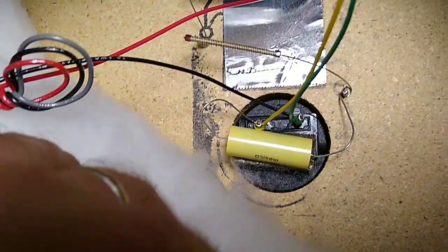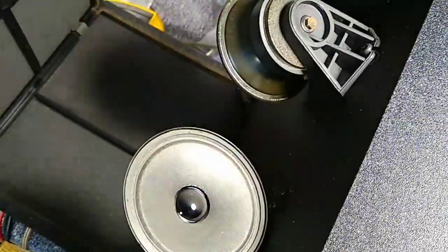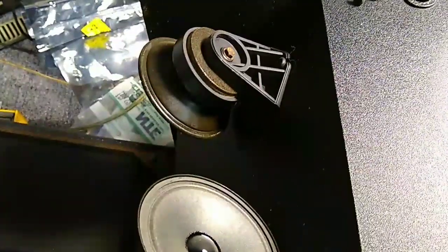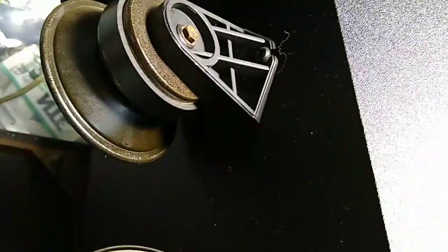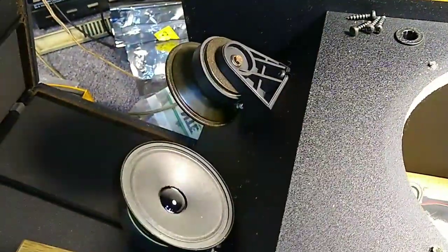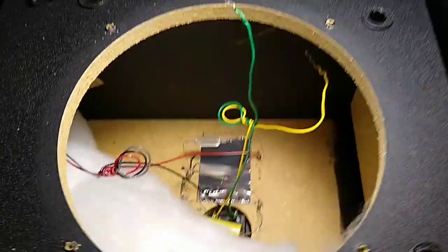And of course there's the giant capacitor there that takes the DC away. On rare occasions, if that resistor is open or the lightbulb is open, the tweeters are probably dead — but that hasn't happened here. I believe that most of the 301 Series tweeters are interchangeable with some of the 501s and some of the 601s; it's basically whatever has this triangular bracket thing here. They wire these tweeters in series too, so if one goes out, take them apart and hold them out and make sure they're both alive. I think they're both 8-ohm tweeters.